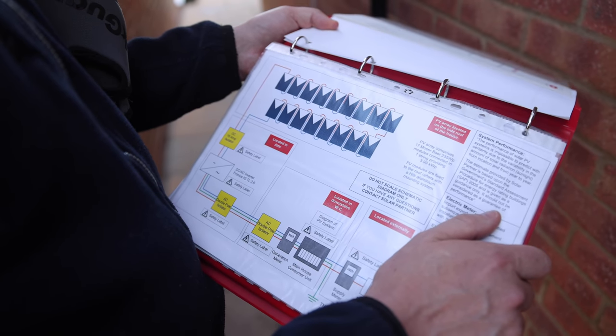When the government was really pushing solar, they offered very generous feed-in tariff rates. Feed-in tariff means you get paid for every kilowatt-hour of electricity your solar panels generate — even if you're using it yourself. Here the customer is getting paid 61p per kilowatt-hour. On a day like today they're producing a lot of electricity, not using much, and exporting loads to the grid. That's effectively wasted opportunity — why not store some of that power in a large bank of batteries to run the house at night?